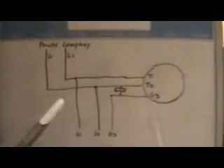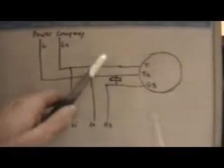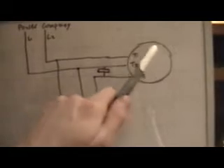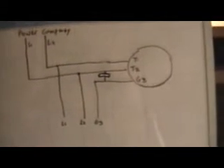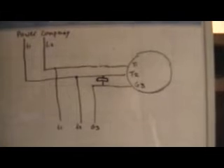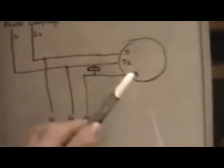Here's the diagram. As you can see, we have Line 1 and Line 2 coming straight from the power company. This goes to your three-phase slave motor — you connect Line 1 and Line 2 to the terminals of your motor. The third terminal of your motor, which if you wire it for 220 volts will be lines 3 and 9, will be your third generated leg — that is why we are calling this G3.